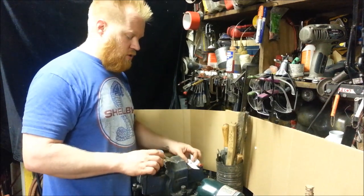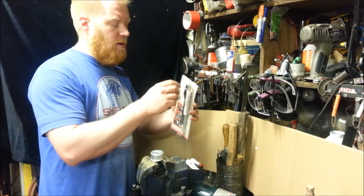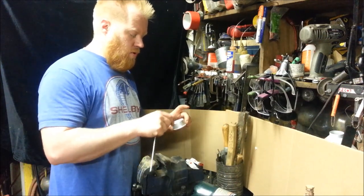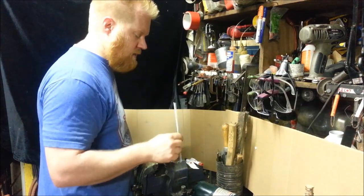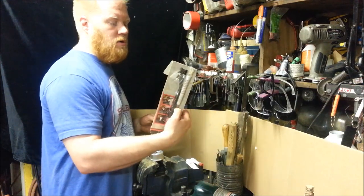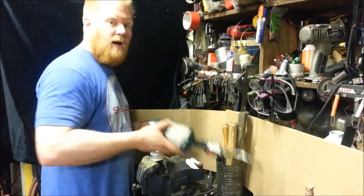But the method I choose to do now is actually aluminum brazing. They call it aluminum weld — it goes by a whole bunch of names, but essentially it's brazing aluminum. You can't solder aluminum. If you had a steel carb bowl that actually developed a hole, you could just put some solder on there. But if it's aluminum, you have to aluminum braze with a special rod. You can find this all over — in most farm stores, on Amazon, places like that. Really neat stuff, but it is a little temperamental.